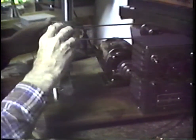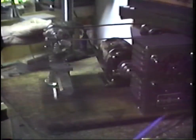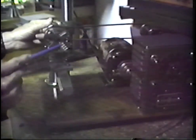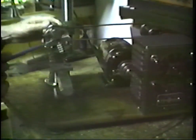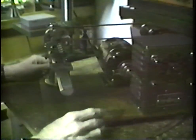This is not very frequently found in the watchmaker's lathe or the clock shop. This is a 4-jaw chuck. This is a step chuck with 4 jaws, independent jaws. These are independently set up with an Allen key, and these jaws are reversible so that you can also turn around and use what is here outside as the gripper in that.